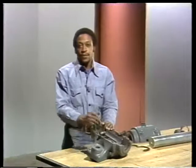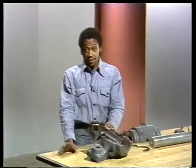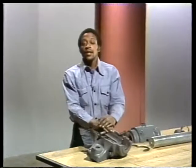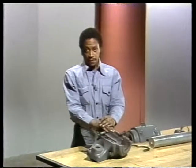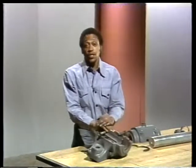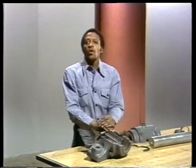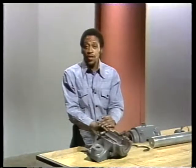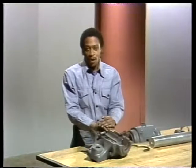It's free to align itself if the shaft isn't quite lined up. To sum it up, we've seen three types of journal bearings: a solid journal bearing, a journal bearing with a split housing, and a ring oil journal bearing. We talked briefly about how ring oil lubrication works and the advantage of a spherical seat. We're going to look at the parts and features of thrust bearings next.